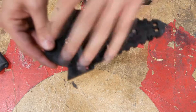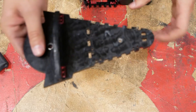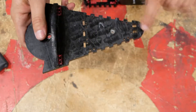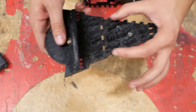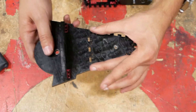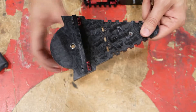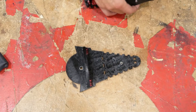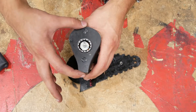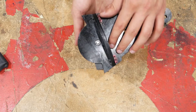The coolest part is definitely the side plate — this tells the story of the whole robot. This was the piece I had to dimension correctly so that everything would fit together. This hole is where the wheel goes; the wheel's a certain radius, but the motor is sticking up next to the wheel, so this defines how long this section needs to be. It also defines the width because the battery has to slot in here between the motors. Basically that sets up a triangle which sets up the overall size of the rest of the robot, with the last variable being the weight budget left over for the weapon.